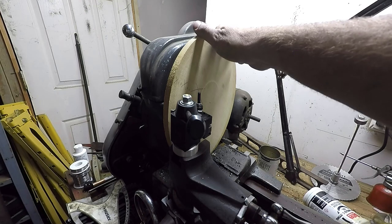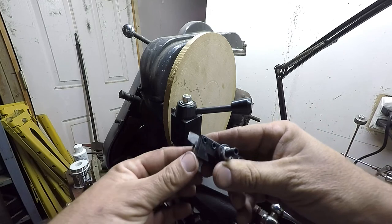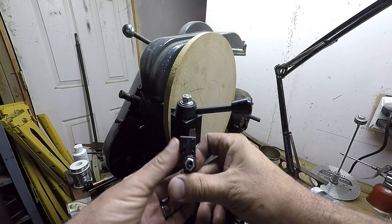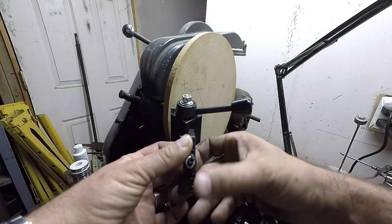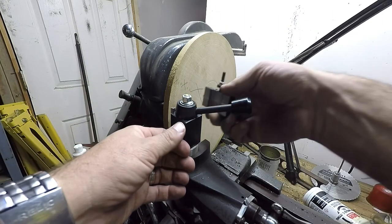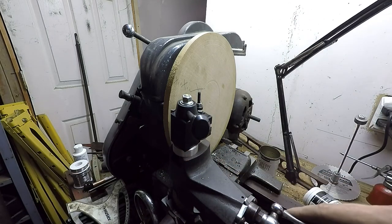I've got it all set up on here. I've carved a special tool bit here. Hope you can see that. You can see it's kind of beveled in just a little bit on each side. But that's to give a draft, you know, because we're going to cut this, and then this will be molded up flat in the bottom of the flask. So, all right. We'll be back here and we'll start cutting some material here real quick.